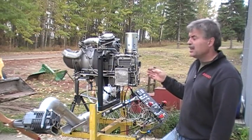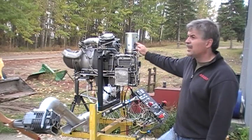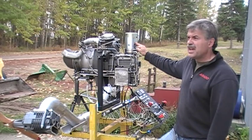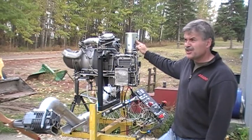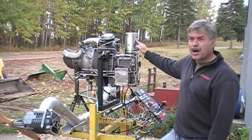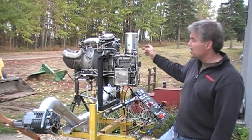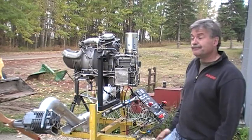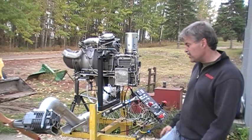In this, it's a hard coupling on a 5-to-1 pad here, so this starter will actually, after it's completed the start of the engine, then be dragged up to about 12,000 RPM, which we're not sure if this starter construction can take. That's why we're going to take some precautions with some protection on the operator. I've also machined a coupling to join the engine and the starter, and put a weak spot or a shear joint on it, so that if for some reason the starter malfunctions, in theory it'll decouple, and you know, it shouldn't have a catastrophic failure, but you never know.